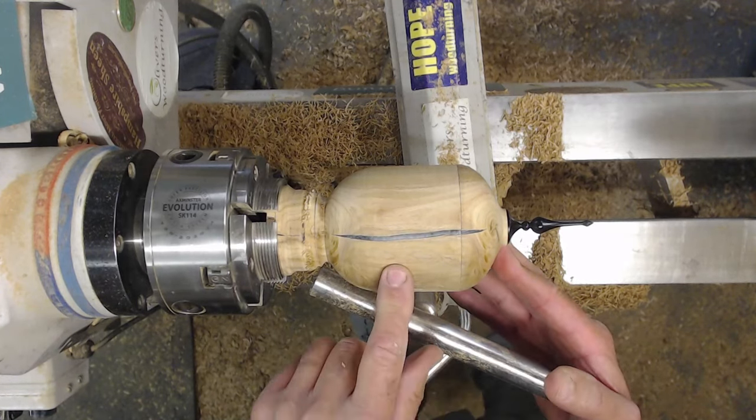That's the inside of the box finished, sanded to 240, Hampshire Sheen pre-thinned sanding sealer, True Grit and Hampshire Sheen high gloss. Doesn't show the shine in there very much, but because of the camera angles, that's why I've got the overhead on as well, but believe me, it's a nice finish. Okay, so we'll get on with the outside, part him off, pop on the finial and the job will be done.